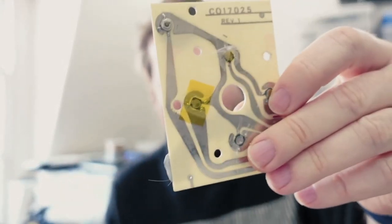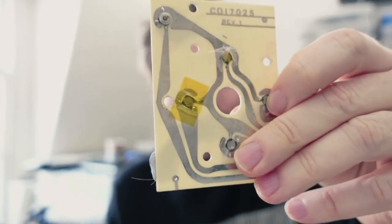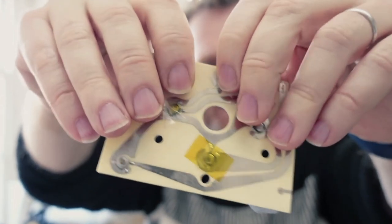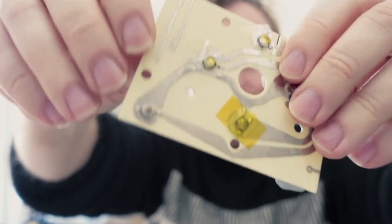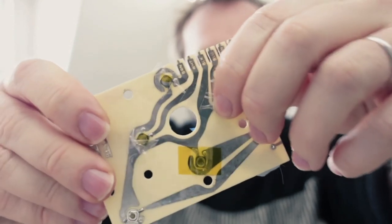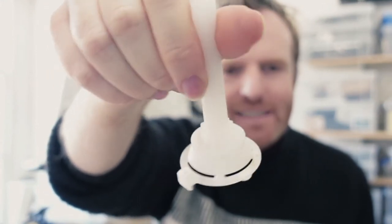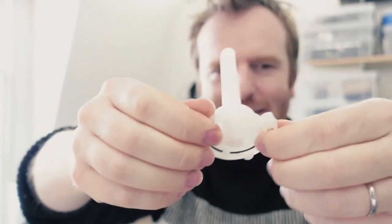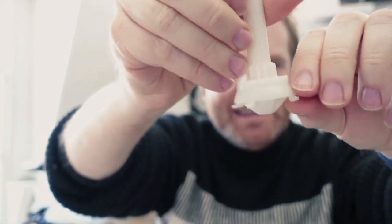What you can do — and here's what I did on this board — I found some really low-profile switches and I just replaced the dome buttons with these actual switches. This survived pretty well, but you can see after Matt's tour that one of these buttons has sort of turned inside out, so even these modern buttons aren't particularly strong. And over time these central sections kind of weaken. Most of the central strengthening parts I've seen are more likely to be in a state where the outer ring is completely snapped off.